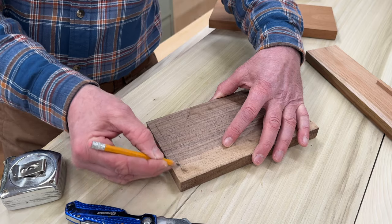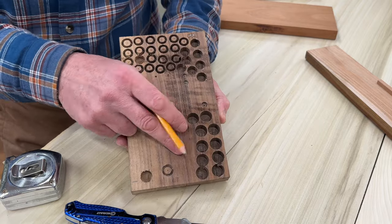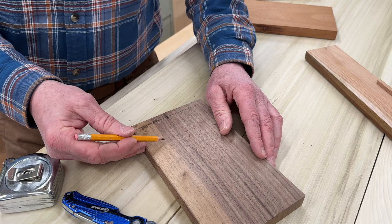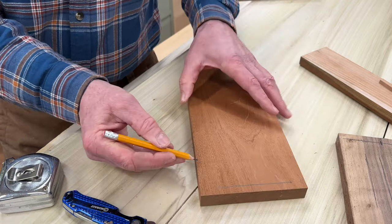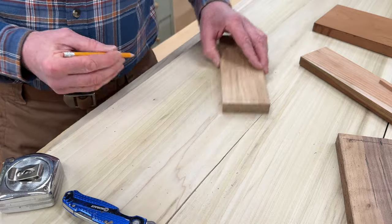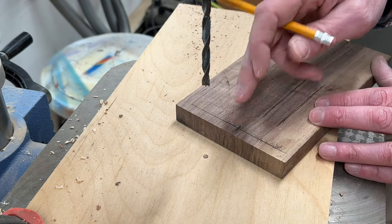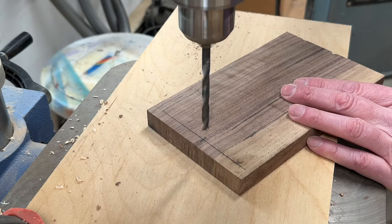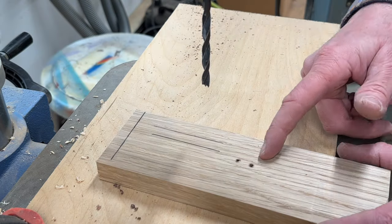I've got a mark here at 3/8 of an inch — that's half the distance between 3/4 — so that's a pretty popular measurement. We'll drill one hole here. I used this to make plugs so I want to make sure I'm not drilling where plugs are. We'll drill a hole right here and then a few out in the middle of the board. While we're at the drill press I'll drill holes in sapele and white oak as well. This is a quarter-inch brad point drill bit — it's very sharp, and that's what you want to use to get a nice clean hole. I've adjusted the drill press to countersink the holes at just about five-sixteenths of an inch deep.